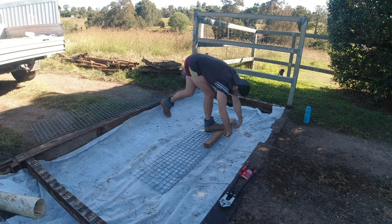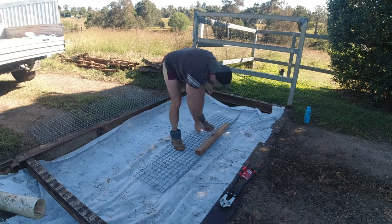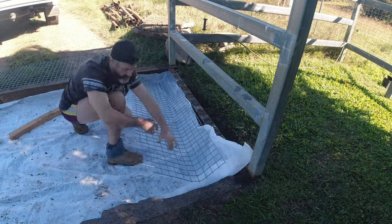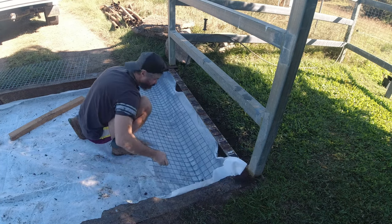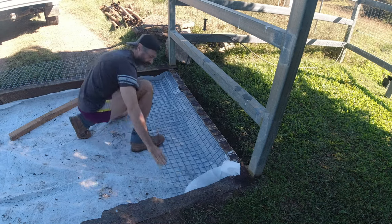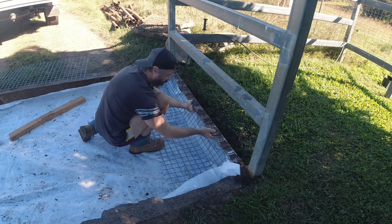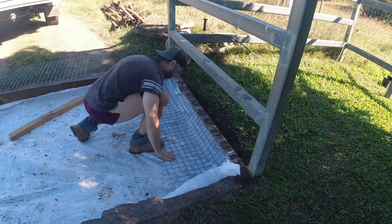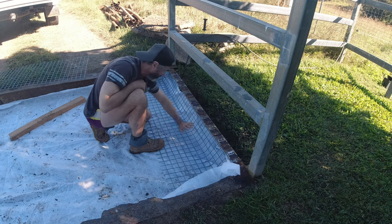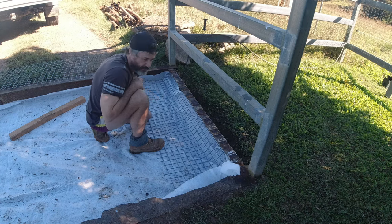Going along and keeping going - almost 90 degrees. Just slip him under there, I'll pull that fabric up later. That one fits up real snug - that's perfect. Hook under there, it can't come out. I'll bring that felt mat - the geo textile - and hook it over there. I just need to get that second one bent up now. Almost 100% guarantee I won't get the same shape, but I'll do the best I can. I'm going to use zip ties to wire them on. Under the rock they won't get sun damage so they should last many many years, and once the rock's in place it doesn't matter - it's not going to move anyway.